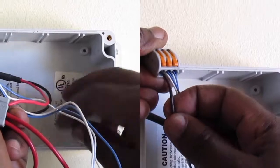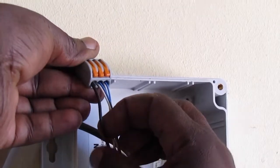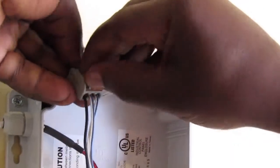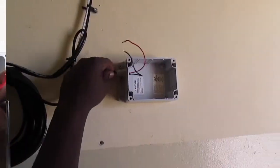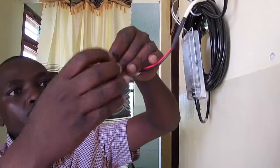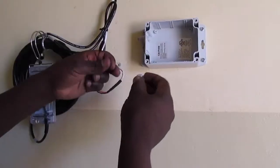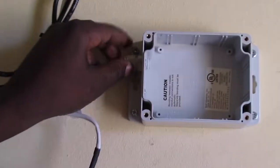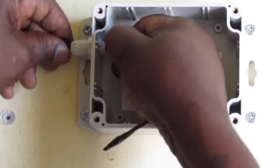Notice how all the red wires are together and the black, blue, and white wires are in the other connector piece. Flip up the orange tabs to release the black and red wires of the white cord coming from the solar suitcase. Remove the white cord and tape the red and black wires, first separately and then together. There is a nut on the outside of the expansion box. Be sure to keep it together with the expansion box. When you reinstall the wires, you will need to connect it in the same way you found it.